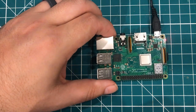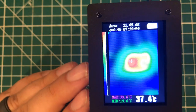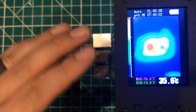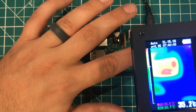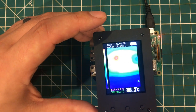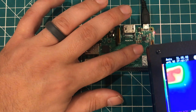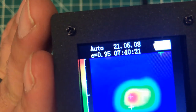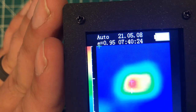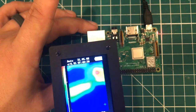I brought the camera way down so that you guys could take a look at this thing with me. First thing we'll do is take a look at a Raspberry Pi — this thing has just been sitting on, it's actually got the RASPAD OS in it. As you can tell, not a super high resolution, but we can definitely tell where the CPU is as my finger comes in and out of the picture. You can definitely get way down there on the CPU and see a hot spot. The thing is pretty warm. You're not going to get detailed information on the rest of the components, but you can definitely see if there's a component that's particularly hotter than something else.